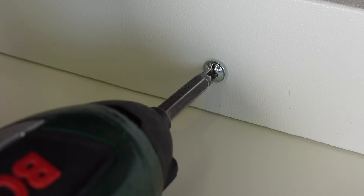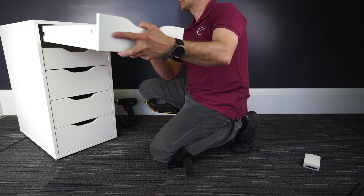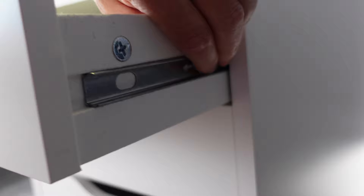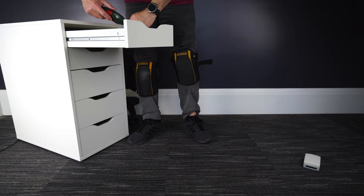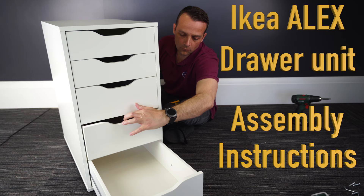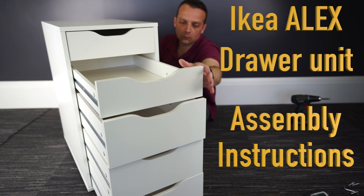For the last one you're going to have to slide it in because you won't have access to the drawers through the top. Slide it in, open it up, make sure the rail is touching the front panel completely so you're in the right position, then you can access the holes from the top while the drawer is open and secure it on each side with the two screws. And this is it — this is how you assemble the IKEA ALEX freestanding unit. I hope you enjoyed. If yes, thumbs up, subscribe to my channel as always — you will make my day. See you in my next one very soon. Thank you for watching, have a fantastic day.